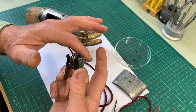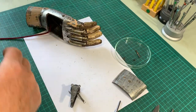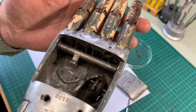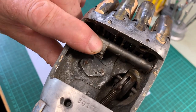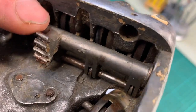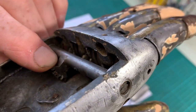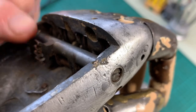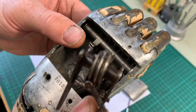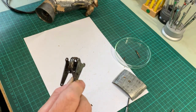The worm and the rack inside this mechanism are made of hardened steel. A great effort was made to ensure that the hand would be durable and not wear out. Here you can see the short sector rack — the turning of the spiral moves that rack up and down, and you can just see the linkages to the fingers. There are four sets fitted on the transverse bar across the knuckles, and those levers extend through to each joint of the fingers to cause them to open and close in a very natural way.